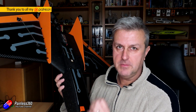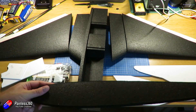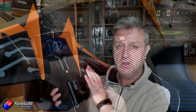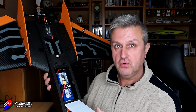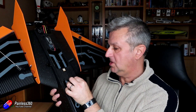Hello and welcome to the final video in this lockdown build that I've been doing. This is the Blackhawk from E-Wings, and if you've been watching along you'll have seen me take it from a set of discreet foam pieces to how it looks right now. In here we have a flight controller running iNav with the GPS in it. We've got a little RunCam 2 here at the front, and with the battery — a 4000mAh 4S pack — I can get the centre of gravity pretty spot on.